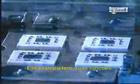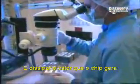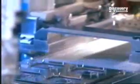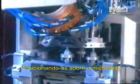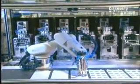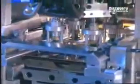Next, they prepare to solder an aluminium cap over each microchip. The cap has two functions: to protect the chip, and to dissipate the heat the chip generates. A robotic arm picks up four caps at a time and positions them over the microchips. They go into a soldering oven at 150 degrees Celsius for about an hour.